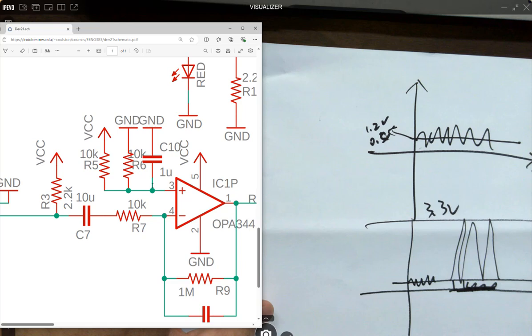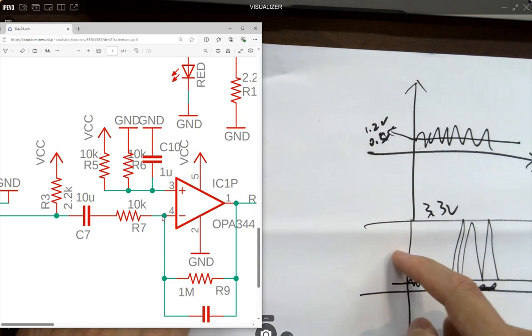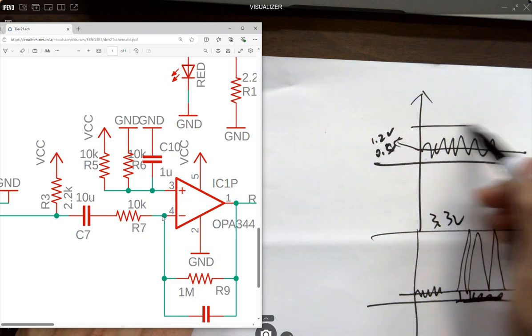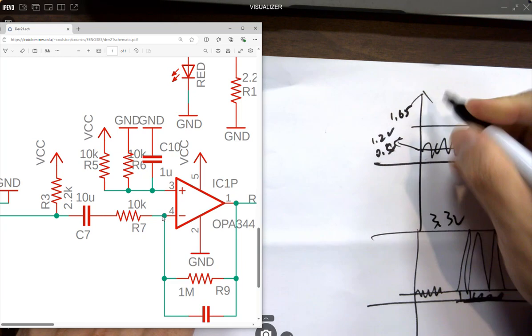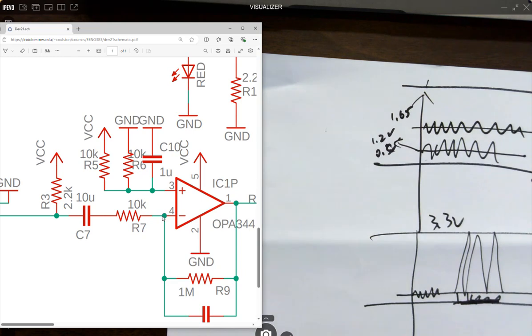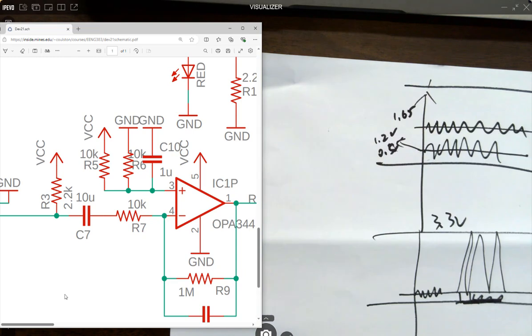And then this one is superimposed onto it, so you are making a uniform DC, or VCOM or VCM, in here. So your signal will be lifted to what? 1.65 volts here, waiting for what? For getting amplified by the amplifier, right? So what were these two parts doing? Could you tell me?